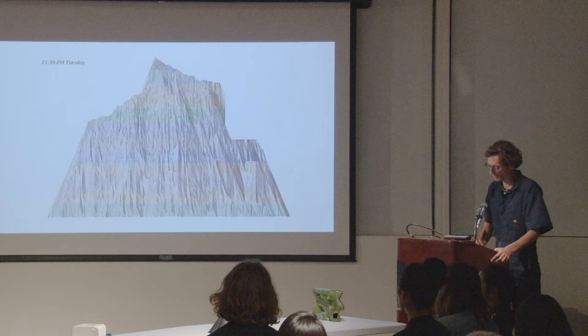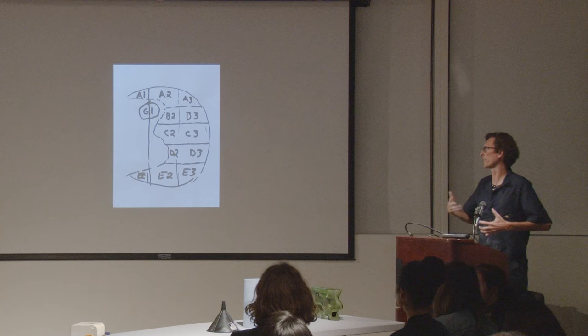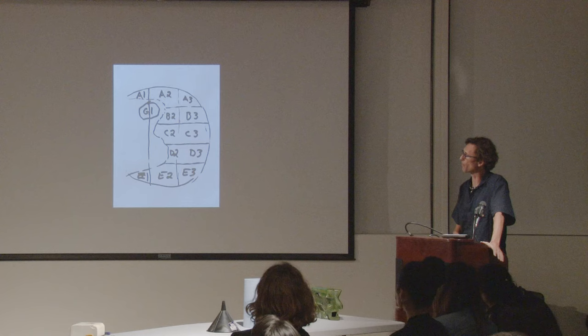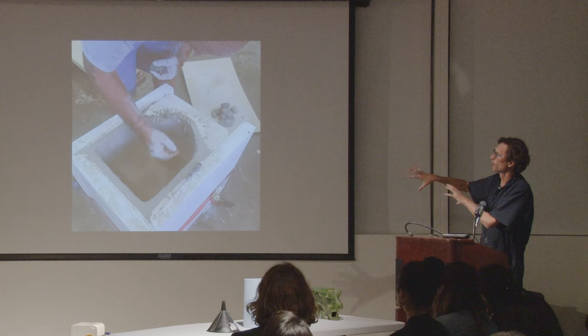And then one of the main goals for this next phase was to produce a ceramic model that would be larger than the ones that you've seen here, just so I could have better resolution, so people could really find where they live on this model. And basically I had to break up that geometry into something like 13 components. These are the ones that are press molded, the process that I was talking about for the buildings from the turn of the century.